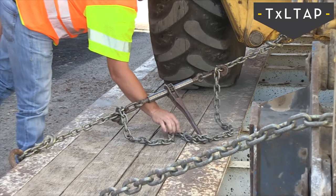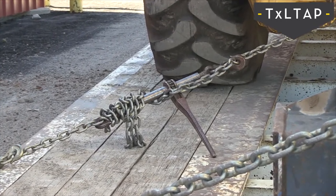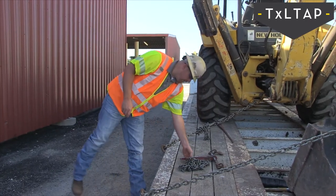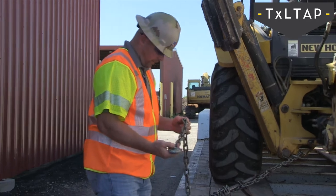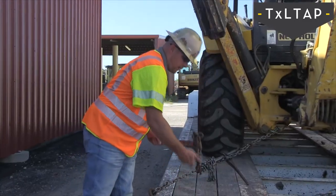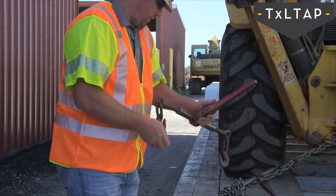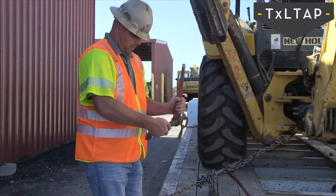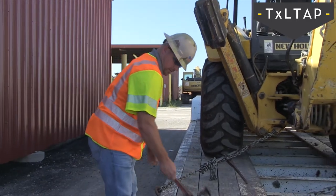With any slack remaining on your chain, just take it and wrap the excess around. The most important thing when tying equipment down safely is to make sure your chains and binders are sufficient. You can tell the grade of the chain and hooks — about every fourth link it will have a number stamped on it. These here are grade 70, three-eighths chain. Make sure the binder you're using is also sufficient — it should say three-eighths on the hook and three-eighths or half-inch on the binder handle. Make sure binders are in good condition: no bends, no kinks in the links, and threads that are not mangled, as damage makes it harder to get everything tightened down.